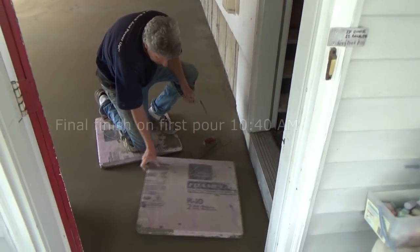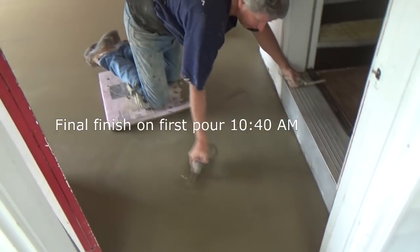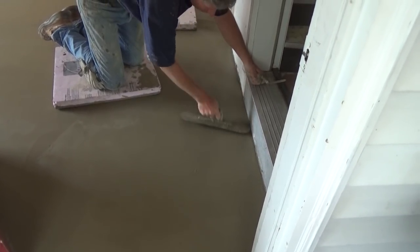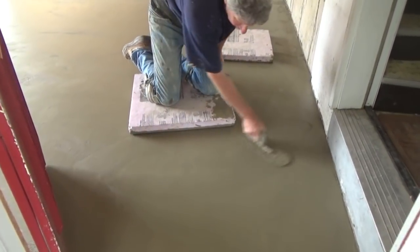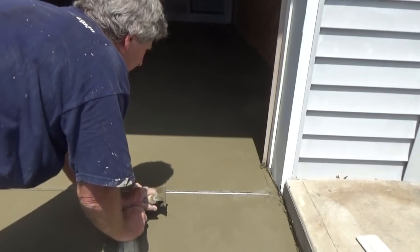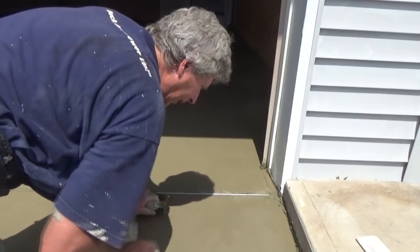We're going to go down like that — this will be the final. You can see it's pretty hot. All the concrete you buy is always a little bit different. This seems to be a little more creamy and it's laying nice and flat. It's 10:40 now, which is about an hour and 40 minutes after we started — but this is good enough for our final finish. Now we're doing the area in front of the garage door. When I got up to here, I pitched it down — I don't want water going in. When I came to my forms, I came down. That's what I do.